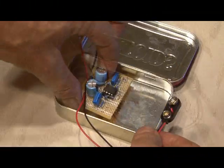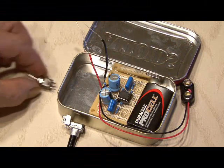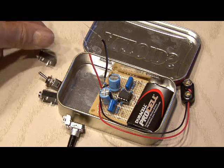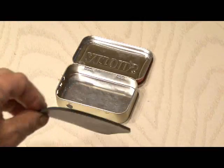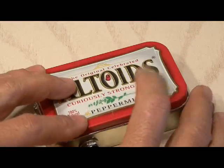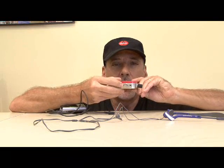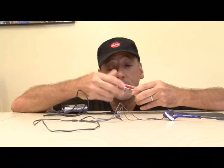Then we need to put in our amplifier and our 9-volt battery, then start lining up where all the remaining components are going to go: the volume control, the input and output audio jacks, and the power switch. To protect the circuit board from shorting out, I cut out a small piece of thin rubber and laid it in the bottom of the Altoids tin. The finishing touches on our mint tin amp are done, including our power switch, input and output jacks, and volume control.